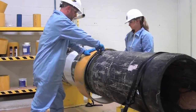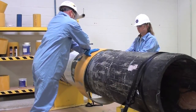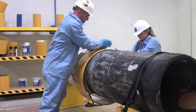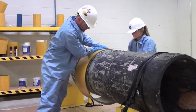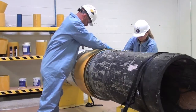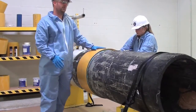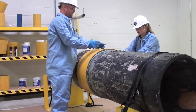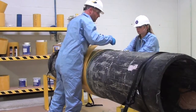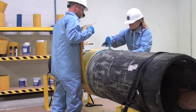Once the clock spring is centered over the repair area, we'll apply pressure where the starter pad is and one by one take the vise grips off. Checking if you've got adequate coverage on your starter pad and if your starter pad is doing its job. One extra step while spool feeding: because we created that gap, the coil doesn't come all the way to the edge of the black line. When you pull off the lip, you'll see where the clock spring scraped off excess adhesive as you were hand tightening. Hold up the upper lip and reapply adhesive up to the second black line.